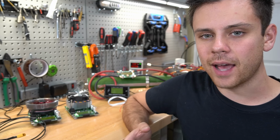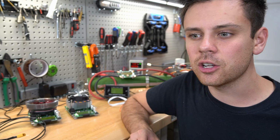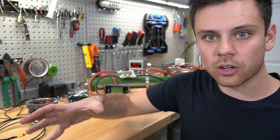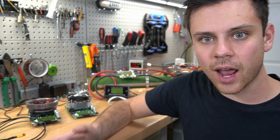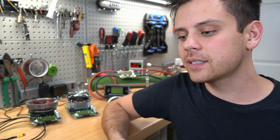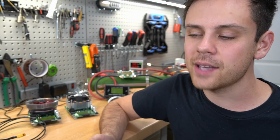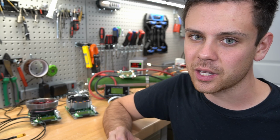And doing a battery capacity test is the easiest way to know the overall health of your battery cells and the components around it. Because sometimes your cells could be good, but your BMS could be faulty or misprogrammed. Let's say your low voltage disconnect is not set properly and you're not getting full capacity. You will find out instantly with a capacity test.